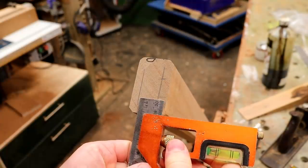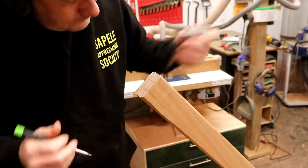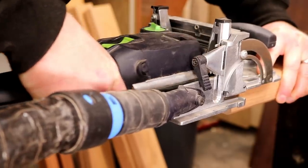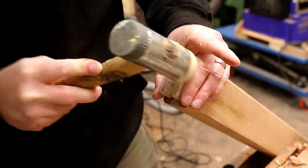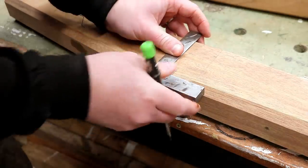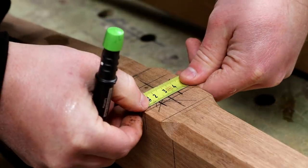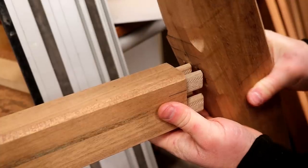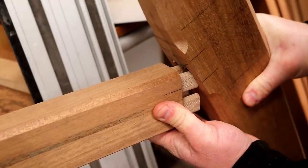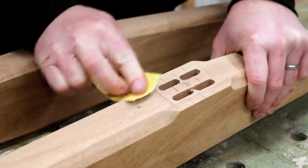I'm going to use dominoes to assemble and here I'm carefully marking up where I want them. I'm going to cut the first holes on the tightest setting and glue the floating tenons in place straight away, which will hopefully make for a less stressful glue up. Marking up the corresponding holes in the leg pieces was a bit more complicated as I want the thinner rails to sit perfectly centered to the middle of the inside of the legs, so I did lots of careful measuring and adjusting the fence on the domino, did a couple of test cuts, and it looked perfect. Those holes were cut on the middle setting just to give a little side-to-side wiggle room for the floating tenons.